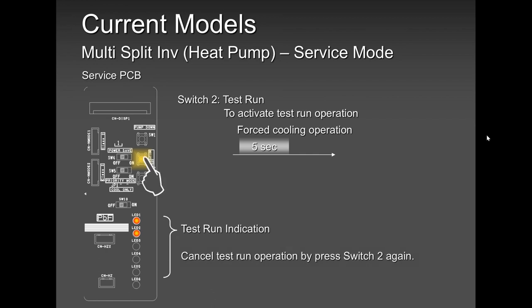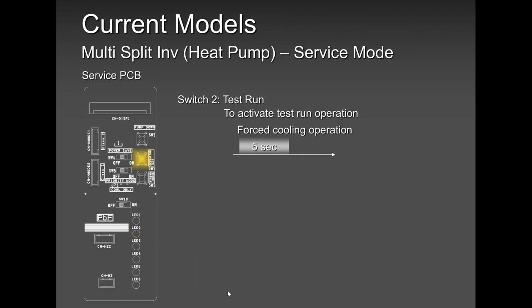Commissioning, the best way to do is one unit at a time. Run one unit at a time. Make sure it runs for at least 5-10 minutes. You're happy, shut it off, go to the next unit. And when I say shut it off, I mean by using your remote controller. I'll tell you one thing, you will never get a callback of crosswire. Do that style and that's it.